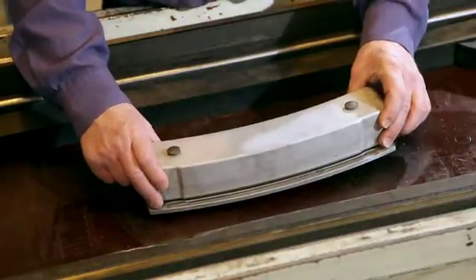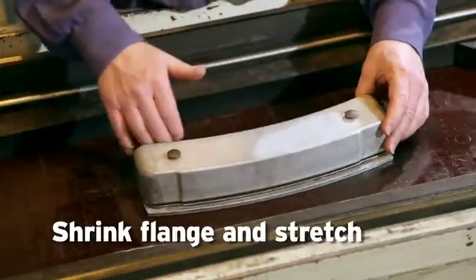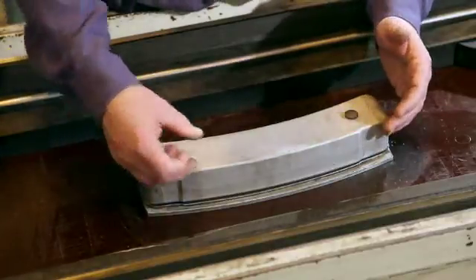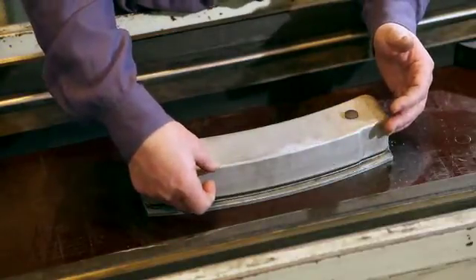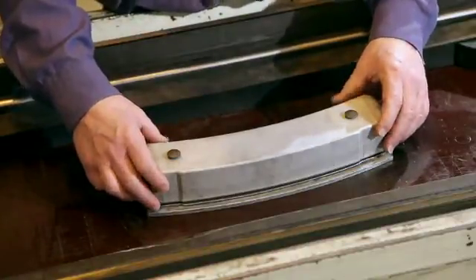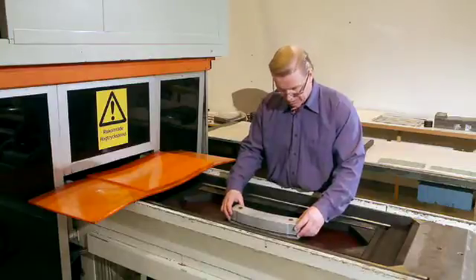The tool itself has a shrink flange and a stretch flange. I'll start up the first pressing with doing a part with a small flange height. After that I'm going to show you how to increase the flange height with something that we call a blank holder.